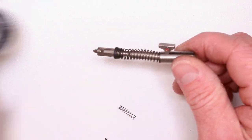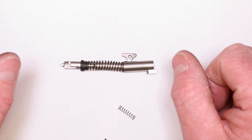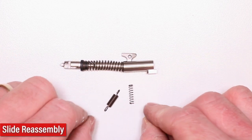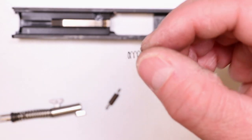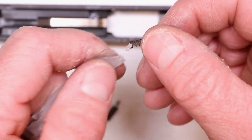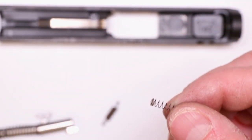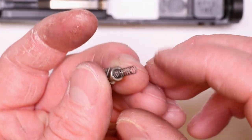Love the Hellcat, but definitely surprised when ours broke. That was never anything we immediately intended on replacing until it did. So we've got the two lighter springs left here to replace. This is where the synthetic grease with PTFE comes in handy — it's going to work like gunsmith glue here. Put a little bit on the end of that spring and it's going to stick right where you want it on the underside of the striker safety.